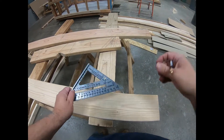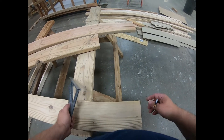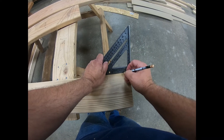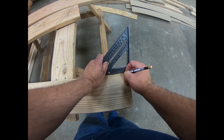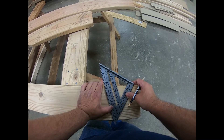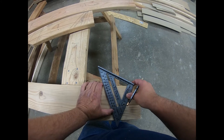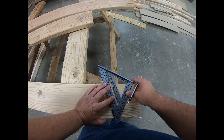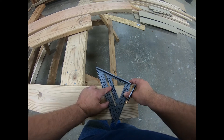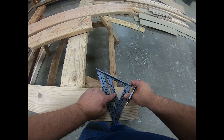In this first video, I'm going to show you how to lay out a hip rafter on a 2x6. The first thing I'm going to do is measure down 1 and 1/16th of an inch. Then I'm going to put my rafter square on whatever slope is chosen or given for your specific project. I'm going to say this one's going to be an 8, so since this is a hip rafter, I'm going to go 8 on the hip valley.